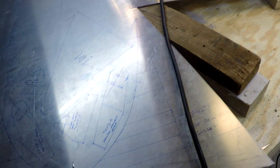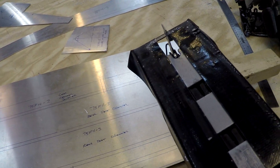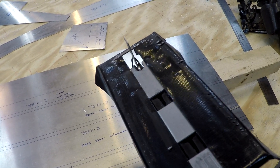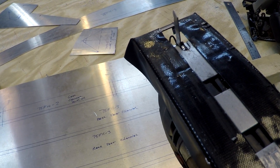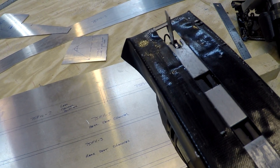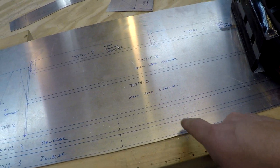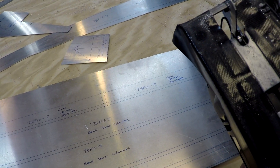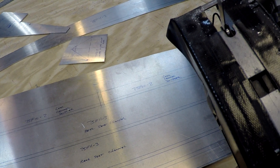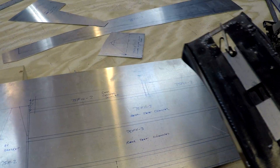For the larger curved parts, the jigsaw is going to be the ticket. One thing to caution about: the jigsaw cutting guide itself is made out of metal, which means it will scratch the heck out of the aluminum underneath. You want to put some painter's tape or duct tape underneath it. The only issue is you'll start gouging the tape from the cutting burrs, so eventually the tape wears down and gets sticky. You may have to do two or three runs of new tape on the bottom of the cutting guide to make it through an entire piece.